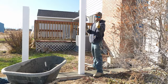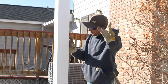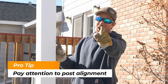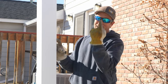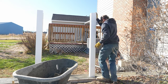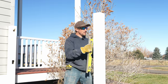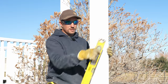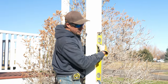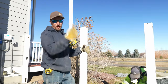One of the biggest helpful hints I can give you: when you get to your gate or your corner, make sure that your holes in your posts are going the right direction. I've done this — I've even set the post upside down — so make sure you don't get in that big of a hurry that you're not paying attention. Make sure that when you leave this post after you get done setting it, you're level and in line, and also level the other direction too, just in case when you come back the concrete's already hard and all you have to do is go up or down with your height.